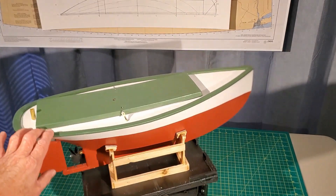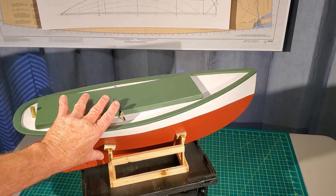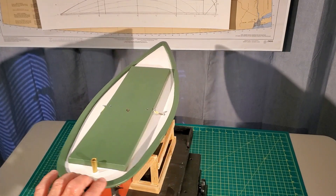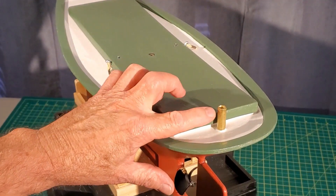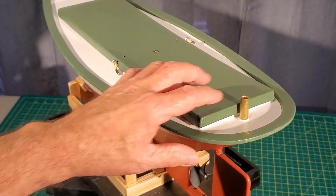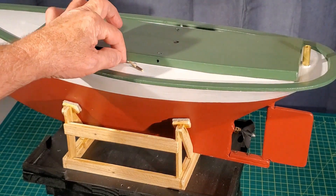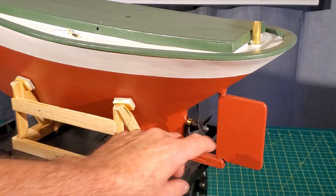Here's a look at the work I've done on the deck of the Fendure model. I took the original opening from the deck layout used to construct the hull, built it up, and made a hatch coaming and a hatch out of it. The hatch is much too big and does detract from the appearance, but it's still an experiment and I could modify it in the future. I have a piece of brass tubing running through the deck where the sheet line for the boom will go in the sailing version. Port and starboard I have two small cotter pins with a piece of string to fasten down the hatch. And down here you can see the 42mm prop and the rudder.